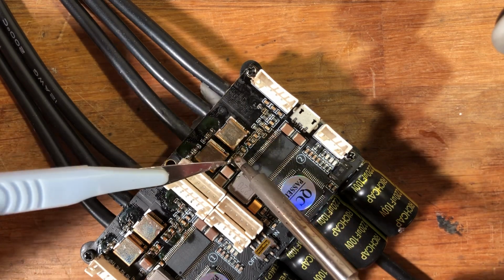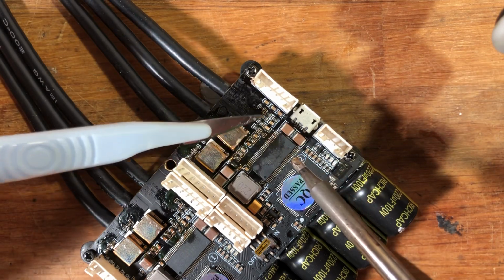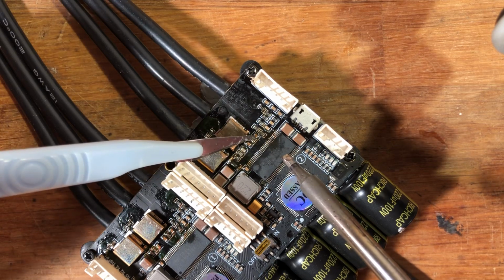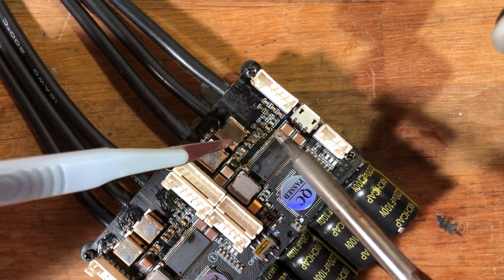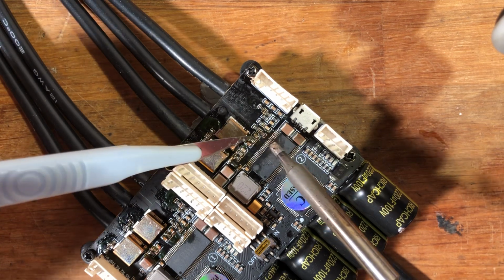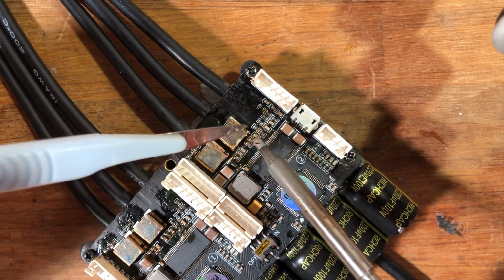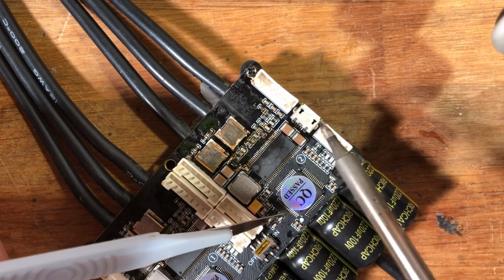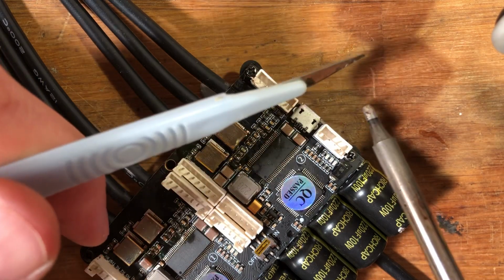I mean, the resistors, if you get those stuck on it, you can always grab a new one, but chances are you don't have these components in stock anyway. So it will be a hassle to look up what component it is and get it ordered and all that. So what I would suggest is have a plan B. If you manage to get one of the other components stuck to your soldering iron, have something to scrape it off quickly. So have like a wooden block or a knife or something to scrape it off quickly.